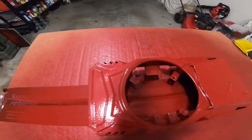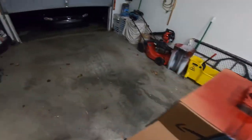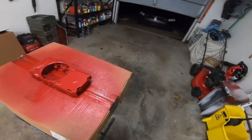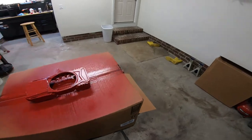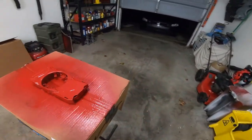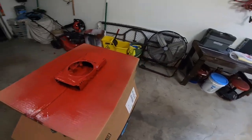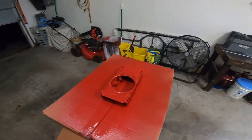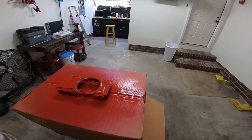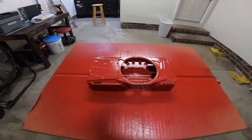After 15 minutes it still looks a little glossy from the light but it's ready for the second coat — just slightly tacky. On the second coat I hold the trigger a little longer and focus on full even coverage. Still be mindful of distance though — if you're too close or go too heavy you'll get globbing and runs, which won't look good. A rule of thumb is to keep at least a foot of distance. The second coat is what gives it the final look.